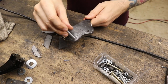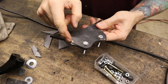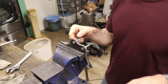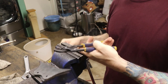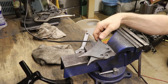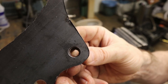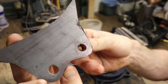I've got some holes drilled in here that I can now fit some bolts in, which will hold this together. Now I can go ahead and grind away the welds and we'll still have this thing held together. Now that we've got everything shaped out the way we want, I'm going to undo the bolts. Now this comes apart into two different pieces, so we've got two. I did the holes slightly larger than needed so that when I weld the bolt on the back side, there's a little bit of play room — because welding pulls slightly, and if I don't get it exactly perfect it'll bind. So I drill these holes just a little bit larger.